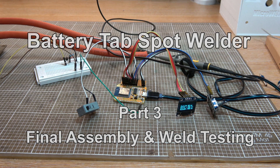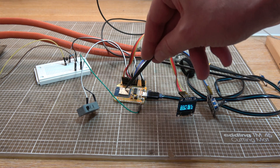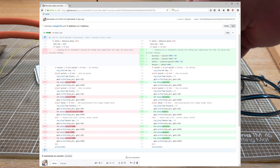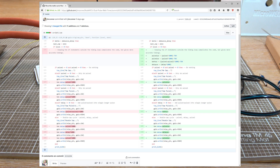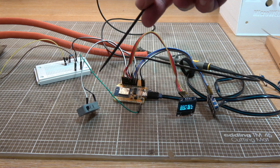I've modified the code on this microcontroller and moved all of the maths out of my timing loop. Given that in a test we were still about 750 microseconds out, I've done all the maths outside the loop and deducted 750 microseconds, so that sorted out the timing issue — which was probably not an issue anyway.